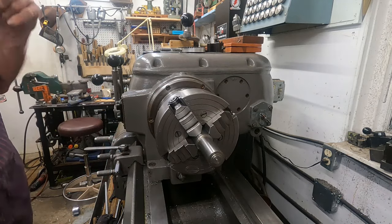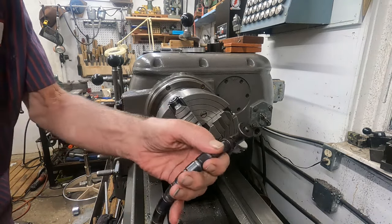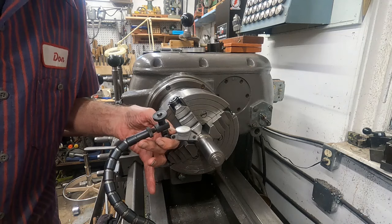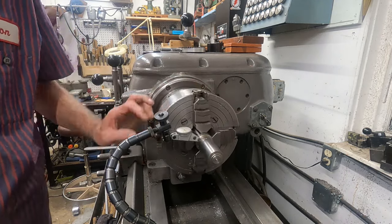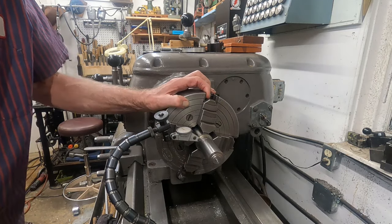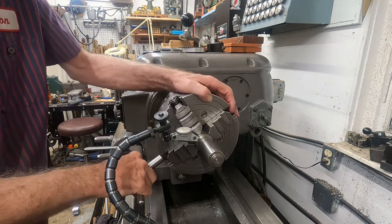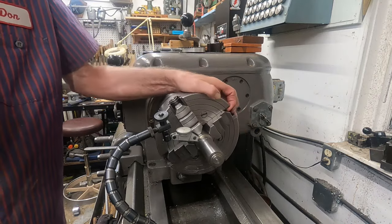I use the three-jaw a little too much. And this is some pretty tough, pretty hard steel here. My 8-inch three-jaw - I have to over-tighten it and I think that damages it. Within ten-thousandths anyway. That's high, that's low. These inner jaws work opposite.